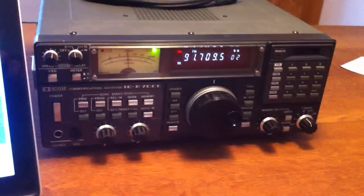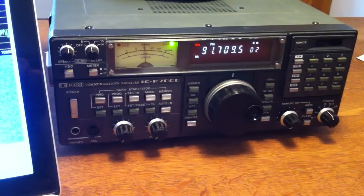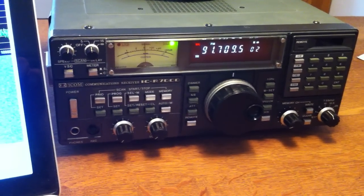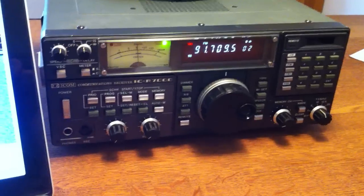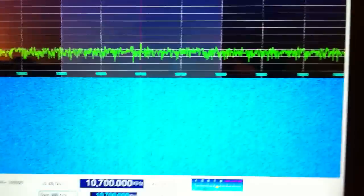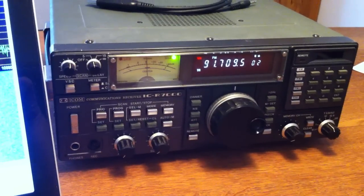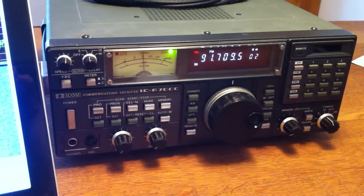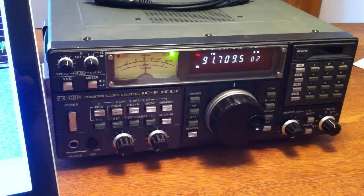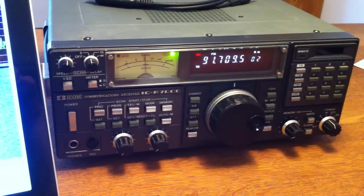Also, if you use the radio as a demodulator and take it out as an AM or SSB signal — going all the way down to baseband and just analyzing the audio output — that 10.7 MHz carrier is going to mess up your AGC. So it's really important to do the AGC modification so that the AGC does not actually react to this carrier, which seems to be there all the time.